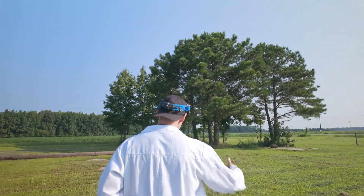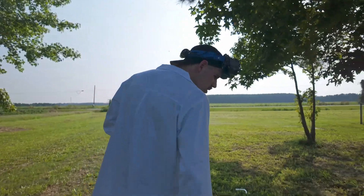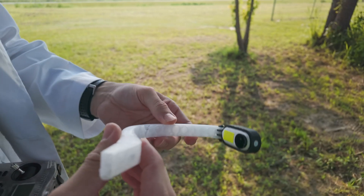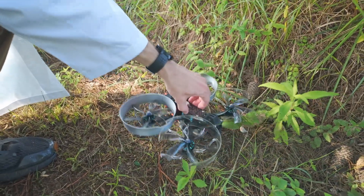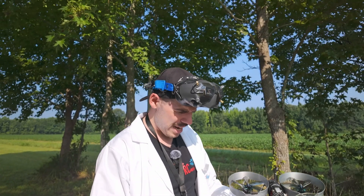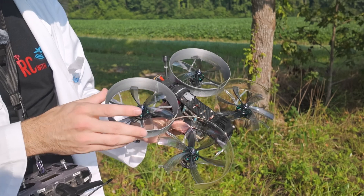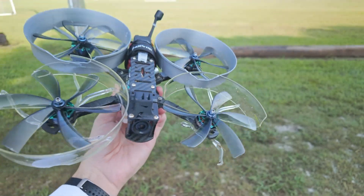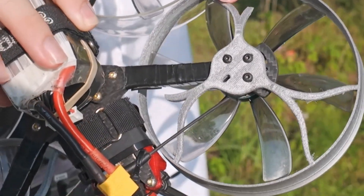I fell out of the tree — so that's good. I think when the throttle goes up quite a bit we're running into some issues. It looks like we did some testing that I wasn't gonna do until later — we did it right now. Here's our camera over here. Look at that — it either got chopped up or just broke right off. Polycarbonate is very brittle. Our beeper is actually coming in handy right now because it has its own battery, so it'll beep even if the main battery gets unplugged. Here are the results: we have broken the two front propeller guards. The rear ones did not break, possibly because of the material — this one is much more flexible, whereas this is more rigid and likely to shatter, as we see here. The way this is 3D printed just doesn't really work super well for strength.